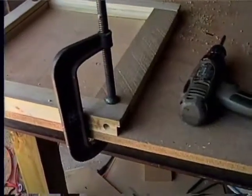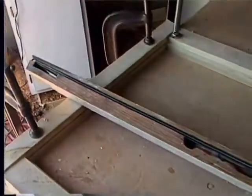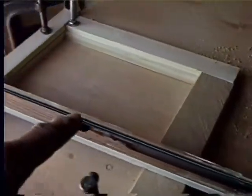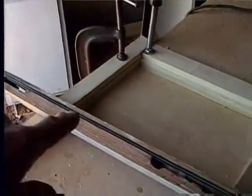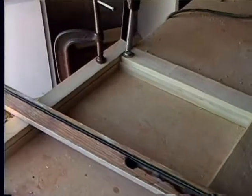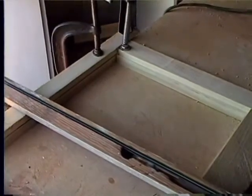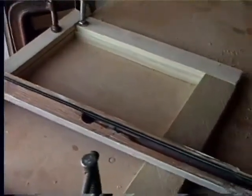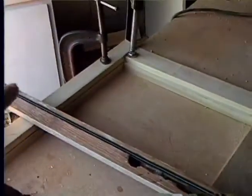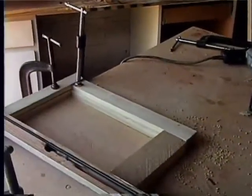Dowels are better. And then you get the other window, and then you see where the stripping is. If you can remember an old window sash, you just set up your table saw to run that weather stripping groove, which is usually 7/8 to an inch and an eighth. In other words, that's the width of the groove. It is an eighth of an inch thick. So if you can set up and cut the groove for your metal weather stripping, it goes on the sides, the bottom, and the other side. And that's it, nothing along the top.